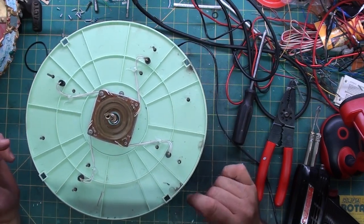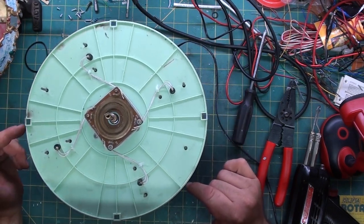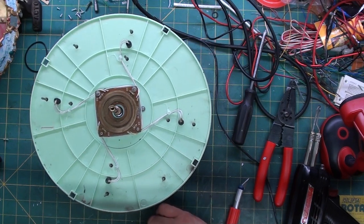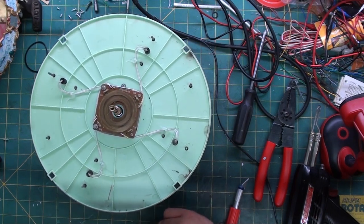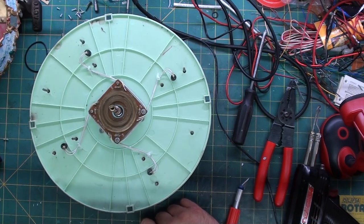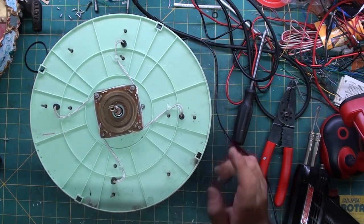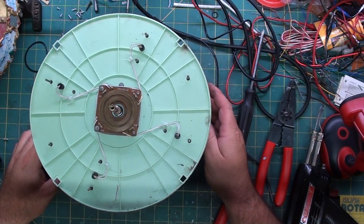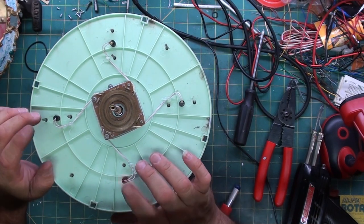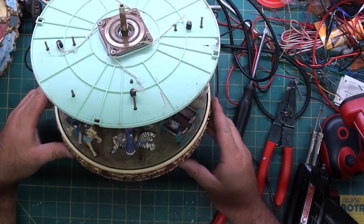Also, before I reassemble it, I'm going to put a little hydrophobic grease, probably a silicone-based grease, on that track, since this is going to be outdoors again this year. But it looks like what's happening is because it sits outside for 6 weeks, sometimes 8 weeks, depending on when he sets up the display, just the band can't handle the outside elements. So I'm going to go ahead and clean it up a little bit on the inside before we reassemble and change the lights. So you don't need to watch me wipe everything down or re-grease it, but that's the next step. I'll be back in just a few to swap out the four lights, make sure they work with that rotor, and then reassemble it and get it back to its owner.